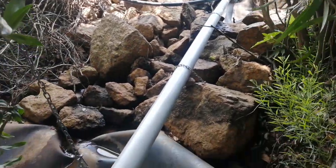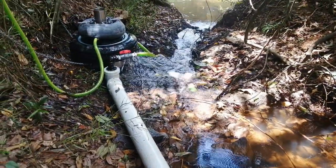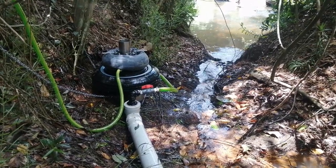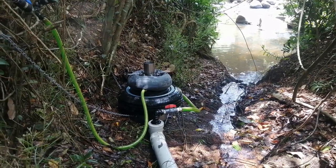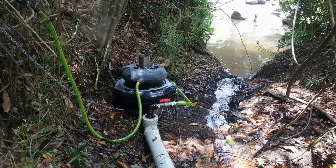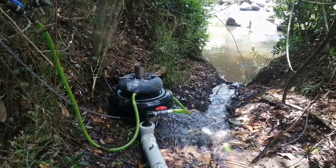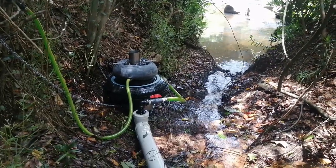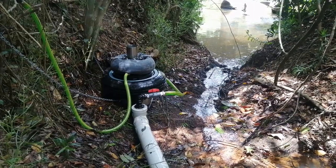It's actually just straightforward — about 10 to 11 metres of piping, and she's delivering around 5 litres a minute, about 6,000 litres a day. More than enough to float the tank, so when the tank's full it stops pumping.